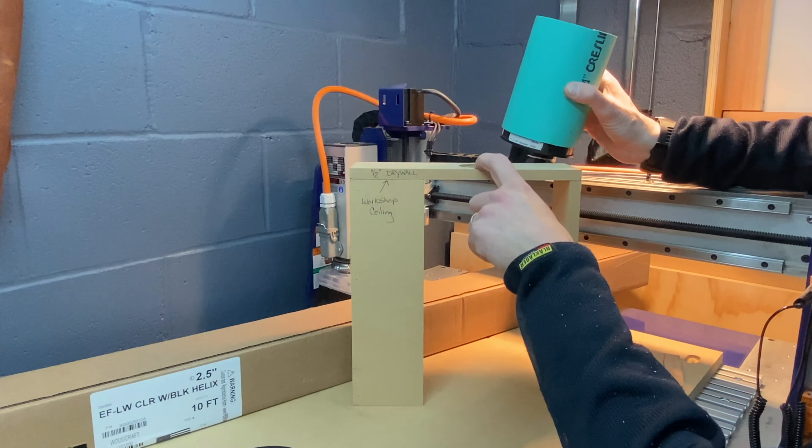Just as I suspected, 32 inches is on this board right here, somewhere about here. Coming out 18 inches from the brick wall to look at the actual top plate, and conveniently if I look down here I can see my trim board. Where the light is shining through is the actual trim board on the wall above the CNC. That tells me that this particular ceiling joist is what I want to measure from — coming out 18 inches from that. It puts us right out here. X marks the spot.